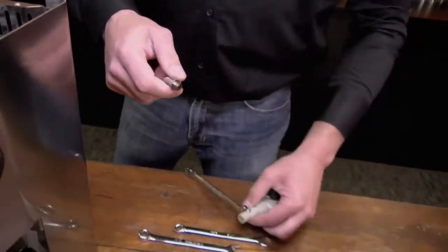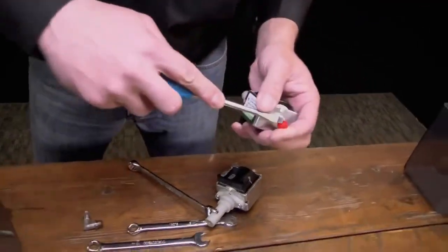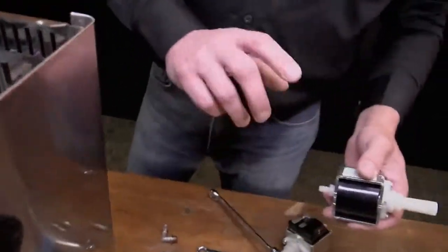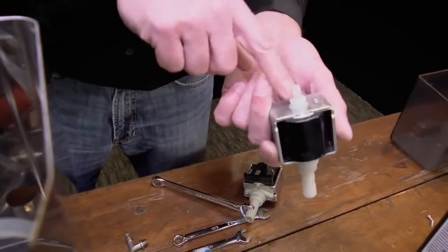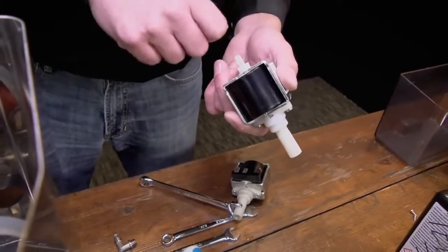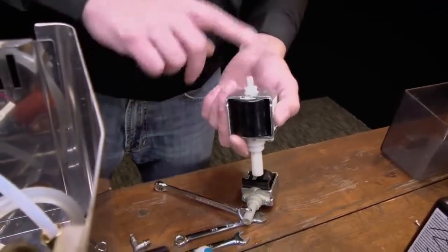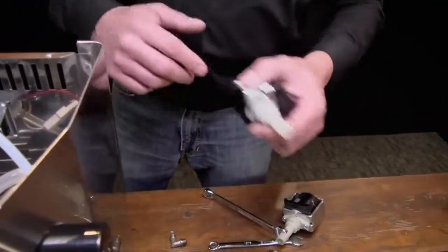Now we've got the elbow off and we'll put it on the new pump. The new pump comes with a cap on the neck and a cap on the bottom — I'll use my flat blade screwdriver to wedge and pop those off. At this point, it's also a good trick to use a turkey baster or air compressor with a nozzle to force air through the pump in case it's seized up from sitting with water in it. If you force air through it quickly, it'll shoot out the other side and you won't have a lock-up issue. If not, it's not a big deal — you can still do force priming if the pump won't take the water.